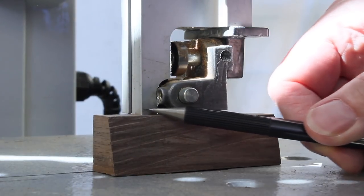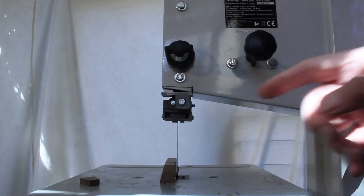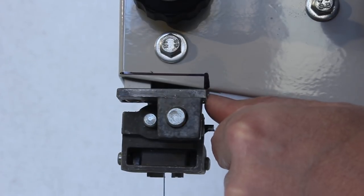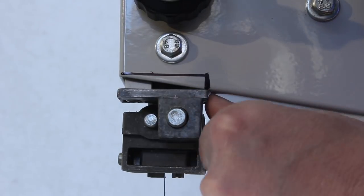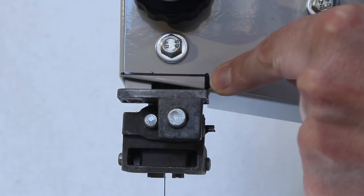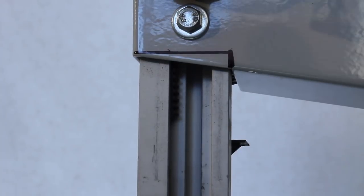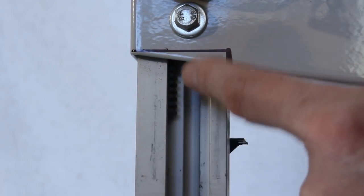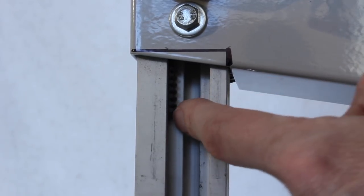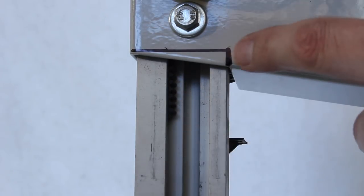The first area of improvement is to shave a couple of millimetres off this post and reclaim this gap — only two millimetres, just fractions, but worth taking. The biggest gain comes from cutting away this piece of metal here; I may need to file the edge of this casting to allow it to go up inside the case. This will give me seven millimetres, which is all I need — a total of nine millimetres from this conversion. I've measured the rack and pinion system and there's enough extra rack that the bottom won't go past the centre of the cog, so we're okay.